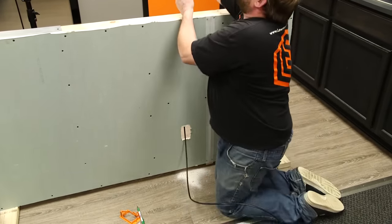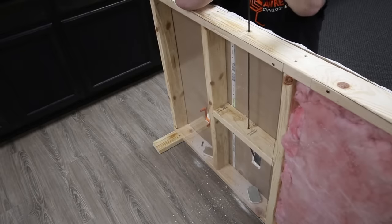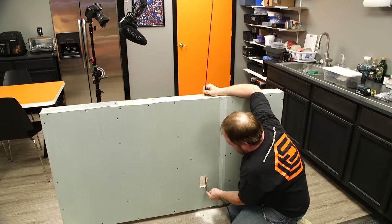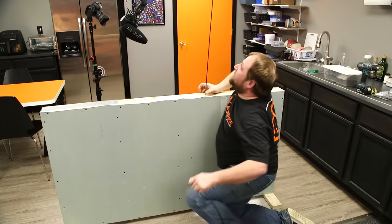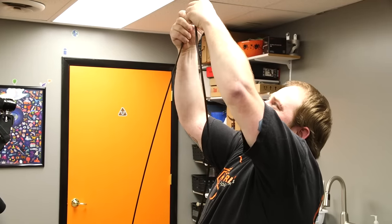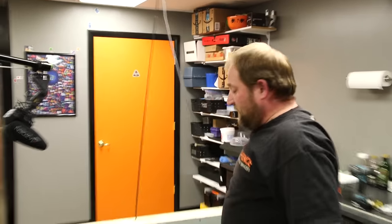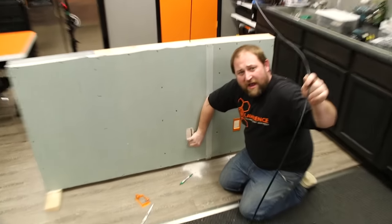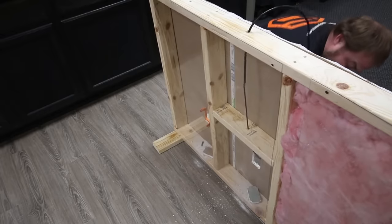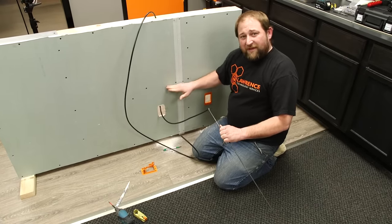Once connected, it's as simple as pulling your bit back out. In this instance we're going to go to the other side — on the back side there's an identical hole up on the shaft, so we connect from this side, because sometimes it's just not possible to pull that bit back through the wall the same way it went in. So we take it from the bottom of the wall and drag it right out, working it until we have our wall fish complete and we've bypassed our fire stop.